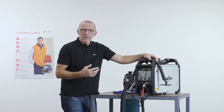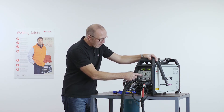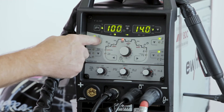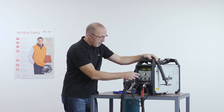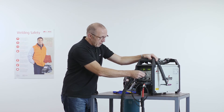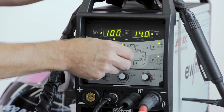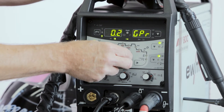Now I want to explain how you can select the welding task. It's much easier and comfortable with this panel. I select trigger mode with this button — 2T or 4T. Then I select the parameters with this click wheel. It's also much more comfortable. You can turn with the knob to set the power through the click wheel, and I can select all other parameters.